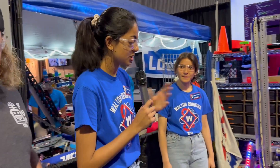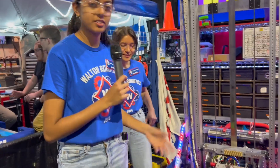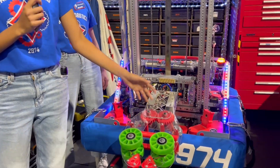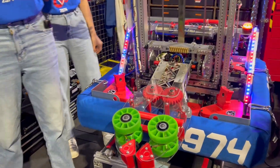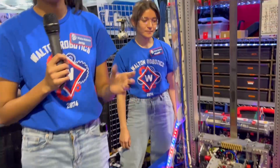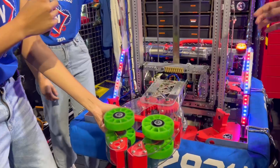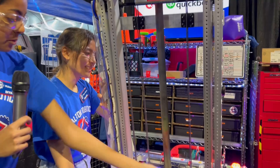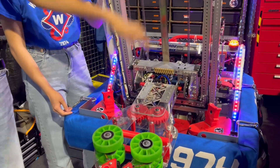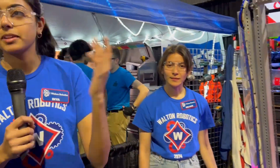So I'm actually going to start with the chassis a little bit. To discuss the size of our robot, it's 27 by 27 inches. We've got MK4i swerve modules with the L2 gear ratio. We kept it pretty simple — our theme was simple, robust, but effective. We've got a pivoting elevator that basically will tilt, and then we've got an intake on a carriage that can go up and down with a wrist that will allow it to rotate and help us place elements and keep it level when necessary.